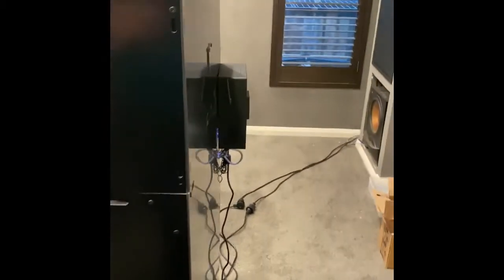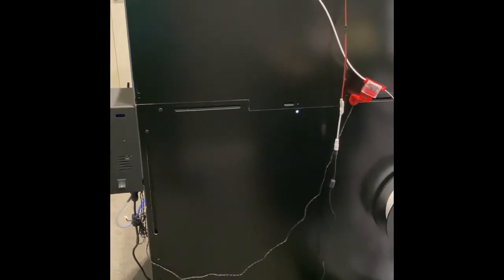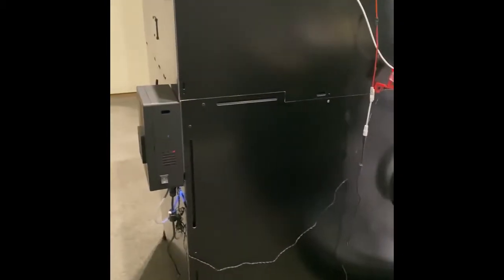So coming around the machine, you do have the option to buy the enclosure, which is a 3mm aluminium composite. I highly recommend it. When you put this enclosure on and you close the lid, the machine's contained. You can add your air purification systems that Modix sell, and trap all your gases inside. If you're using ABS, it can let off a kind of fume, and probably good not to smell it. So that option's there. That's a benefit of the enclosure. Also, keeping some of that heat in.